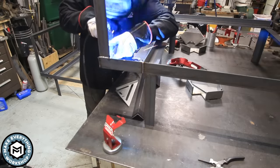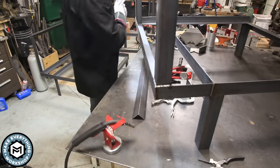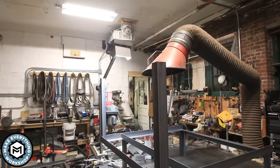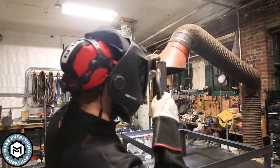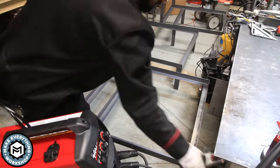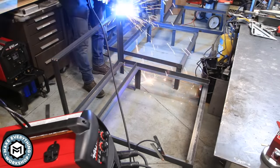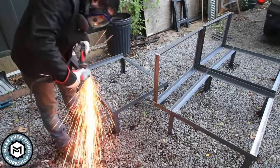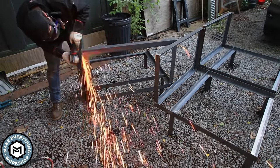You'll see I'm welding on the insides and outsides of these vertical supports. With the frame done and the legs on, these vertical supports are going on the back of these carts so that when the carts are strapped up inside a truck, the fan housing on the back doesn't get crushed. There's also a crossbar on the top. I'm grinding the corner of that material so that it sits inside the radius corner on the 2x2 angle from the mill. Most angles are going to have that rounded corner, so if you leave it sharp on the piece that butts into it, it wouldn't line up properly. I'm making sure I have nice penetrated welds on all the corners, and then I get outside and use a flap disc — it's really quick to get rid of the extra weld.